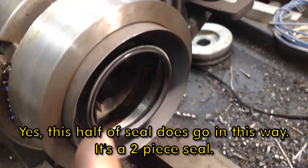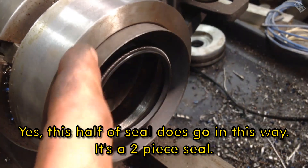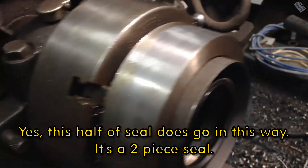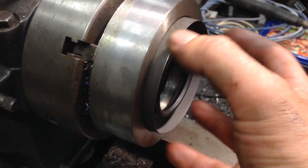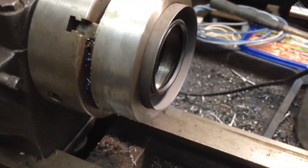It's going — I am two thousandths over at the start of the seal. I think that's what it's supposed to be; I couldn't find any data on the seal online. It's going to be like a four thousandths compression on the back side. It might be a little tight but I think it'll go.